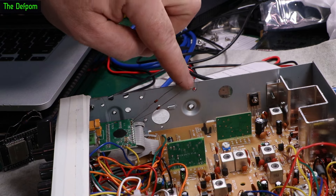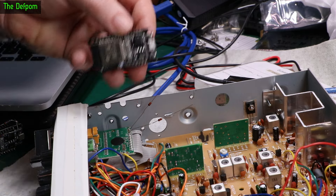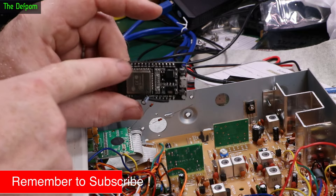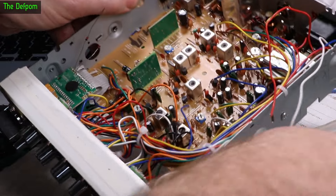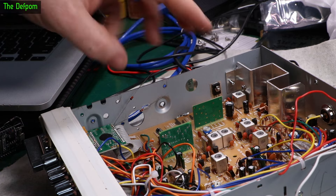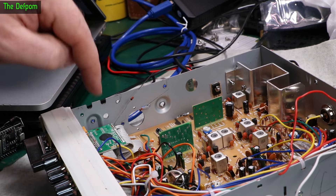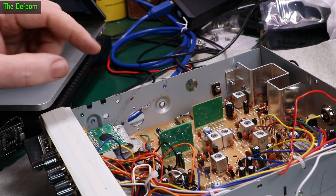I've drilled three holes on the side of the chassis to mount the ESP32 so the USB socket is still accessible for programming. The serial connections are along this edge, closer to the source. I've taken out the two-pin wire from pins 2 and 3 on that socket. I need diodes in series because I don't have voltage converters between 3V and 5V for data connections. The diodes create a voltage drop and block DC — when the MCU pulls down to 0V through the diodes you get a 0.6V difference, but it still works fine.